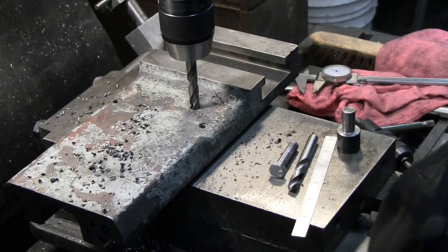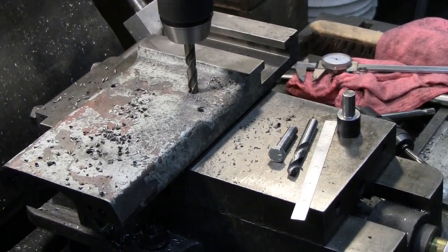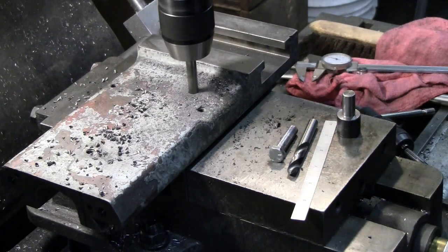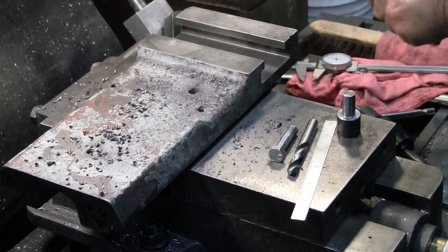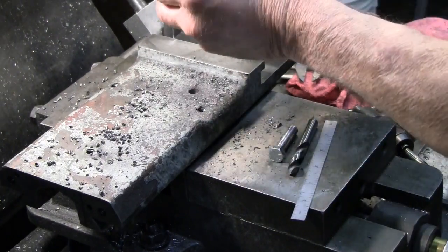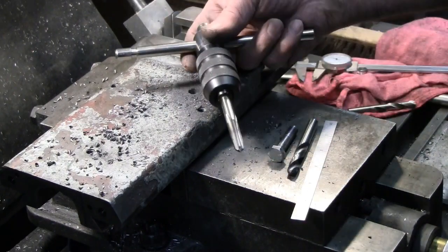Now let's run up manually. Let's make it 7 turns just to be safe — still plenty of threads in there. That'll give us room to let the tap down in there and get close enough to the bottom that I can finish with a bottoming tap. And there will be clearance for the larger diameter of the tap.